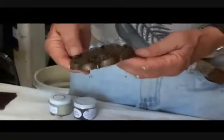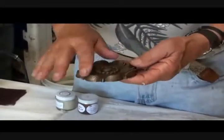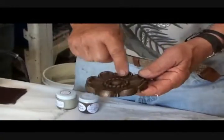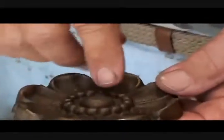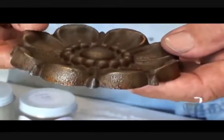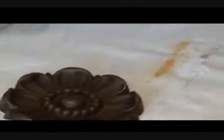Okay. So what's that next piece that you have there? This is a piece of steel. This is a hot roll that I burnished back on the high points to give it a polished look. I've left the fire scale in the recesses, and then we have solvent-based dyes, and I put my orange solvent-based dye on there, and then over the orange dye I'm ready now to put some sort of a seal coat. So we have 2 choices here.